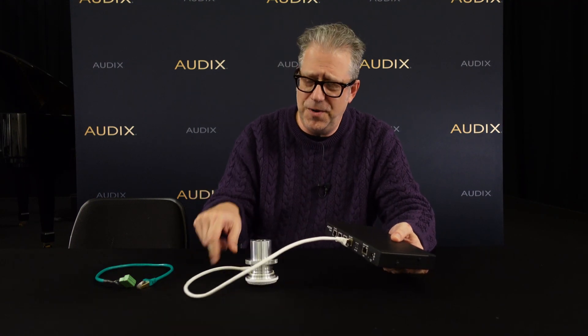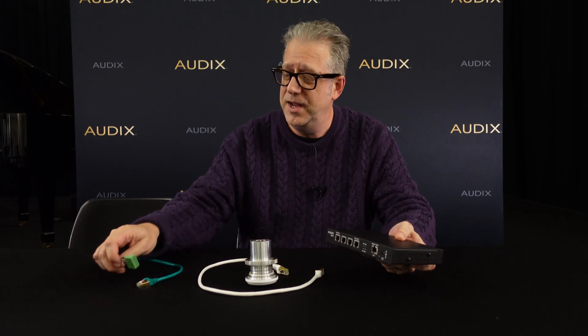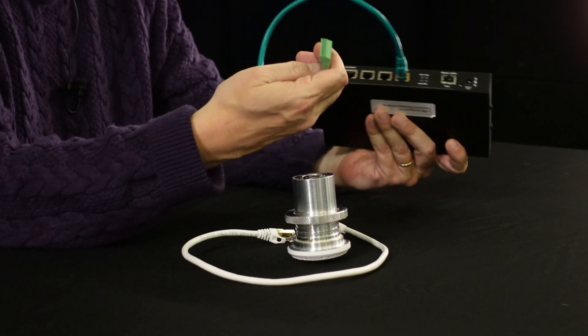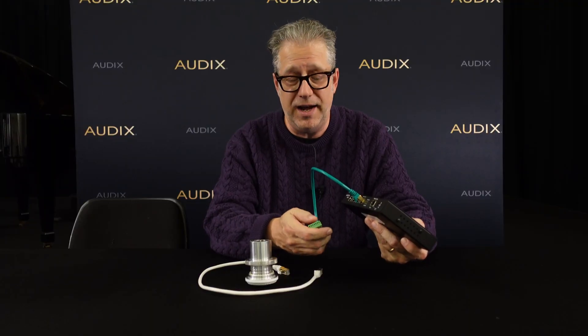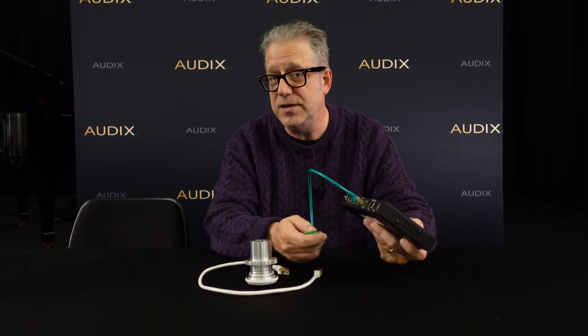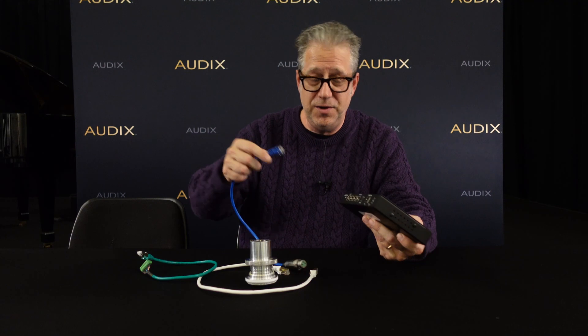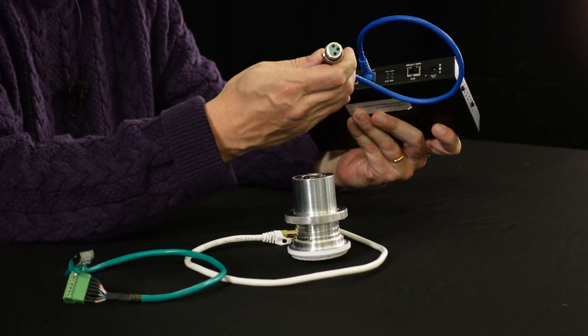So you're probably wondering, if I didn't have Audix microphones, could I use this box to control third-party microphones with LEDs? And the answer is simply yes. For that, I fashioned here a category cable on one end and then an eight-channel Phoenix connector on the other, so that gives me independent wiring for two LED colors as well as the microphone itself. If you want to go even simpler, we can do category on one side and a simple XLR on the other side with phantom power. So yes, we can facilitate third parties with this very easily.